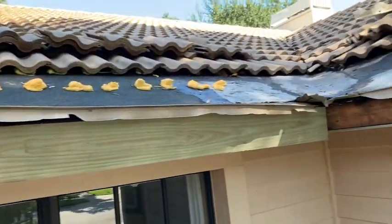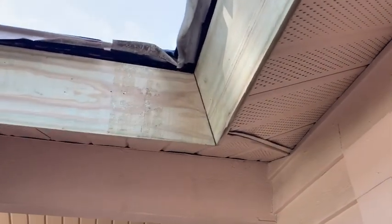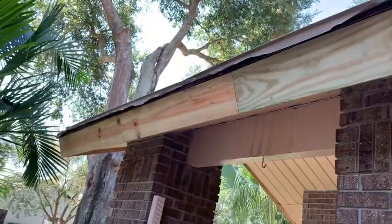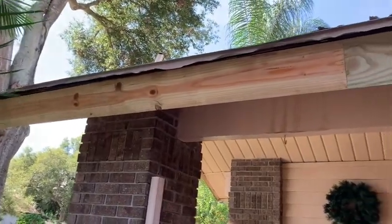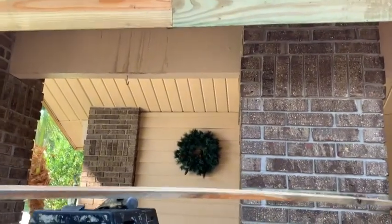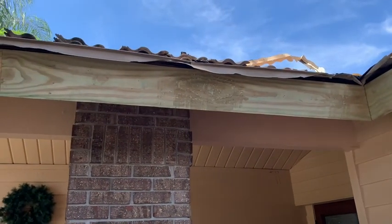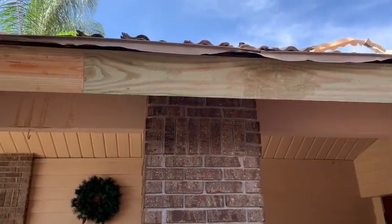Got some of it done - I still have to put the furring strip on and put a new board on that side that was rotted quite a bit. Nice tight joint there - that's what you're looking for to keep the water out. Not too bad for a DIY guy. If I can do it and I'm not a carpenter, you guys can do it too. I'm just here to give you a little confidence and save some money. The roofing company wanted like twelve dollars a foot installed for new fascia board and that can rack up some dough.